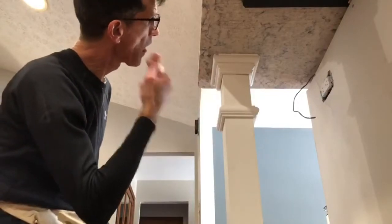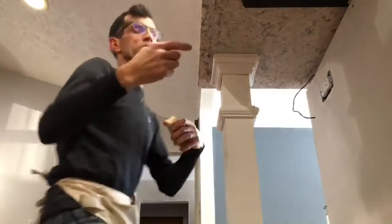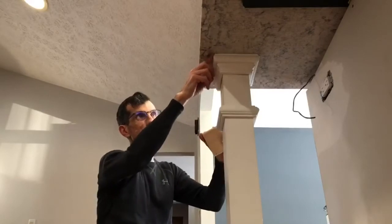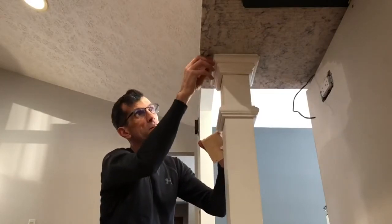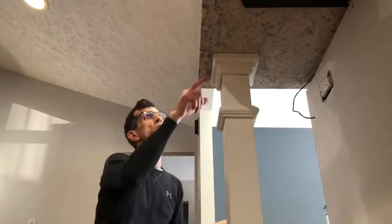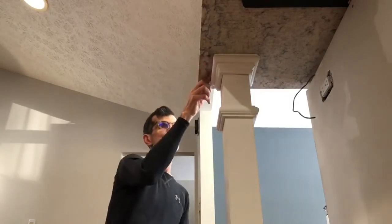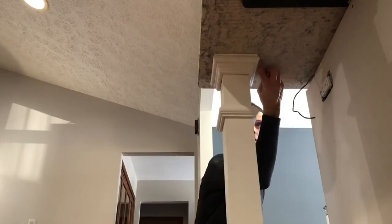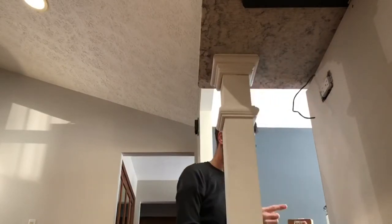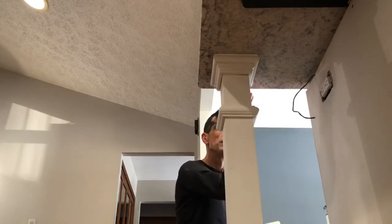I'm going to wet my finger a little bit and smear that caulk right into that crack real good. Make sure you buy a caulk that's paintable — read the label to make sure it's paintable. We're going to come back and paint this a little bit later after the glue dries, and this caulk is going to help to hold it right in place and give it a little more strength.